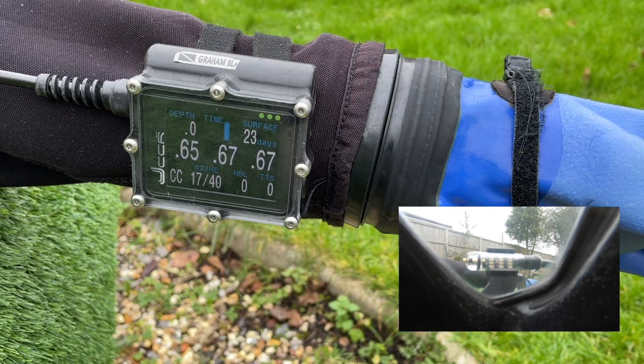This is in line with my thesis — the rebreather is not trying to kill you but rather keep you alive. So again we see a little bit of an overshoot as expected, a bit less in this case since we're breathing in the loop and we get some mixing going on. This variation up and down of the PO2 is expected as the loop stabilizes. If you're underwater and trying to maintain neutral buoyancy this can obviously be a little bit of a challenge. Once you get more practice with the rebreather you can do this on the fly and maintain loop volume, which will maintain neutral buoyancy.